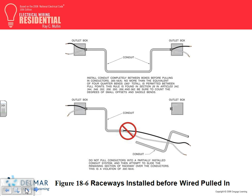If you're dealing with conduit, project manager, my friend Muhammad is going to be project manager. Number one, for a conduit system, you can't bend it more than 360 degrees. Here is a 90 degree. Have I exceeded the 360 degrees here? No, I'm cool. I've done that a few times.